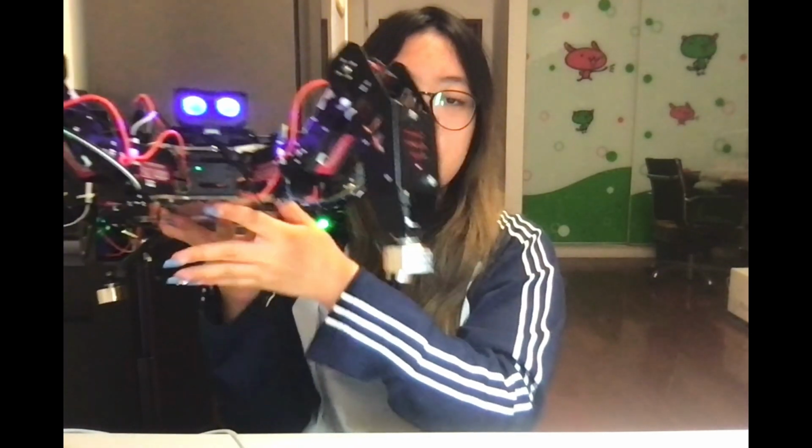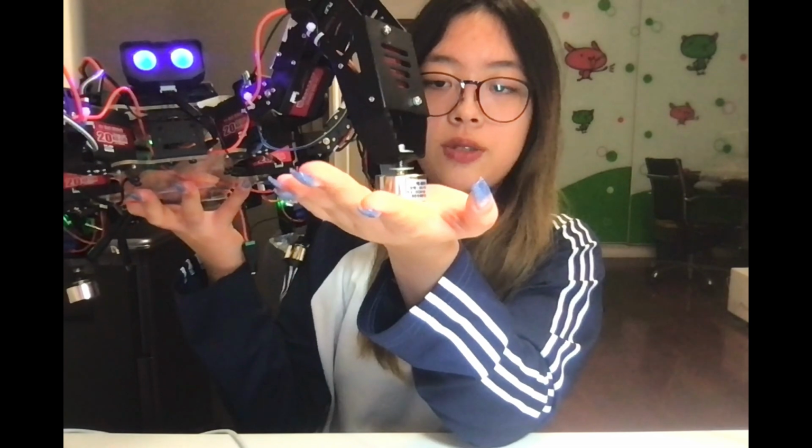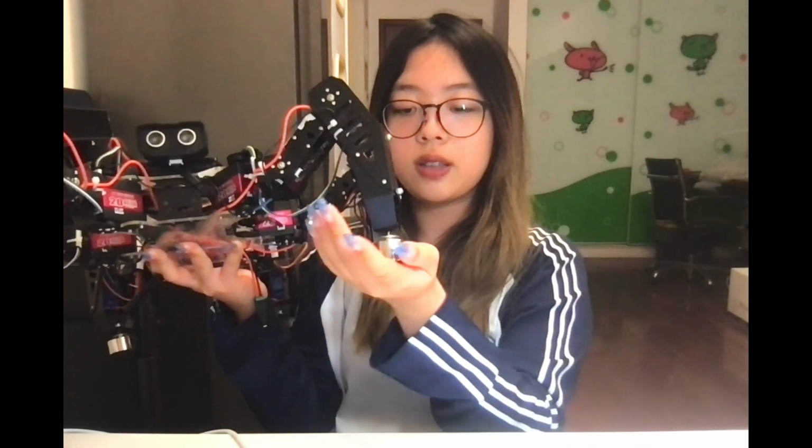this fake spherical joint is necessary to ensure that the joint connecting these 2 parts is loose. Like if they have a certain angle, it still can be pulled down and be attracted to the wall. And also, when the leg is moving forward or backwards, this part needs to be rotated at a certain angle. So this joint also ensures that. So then I recorded the gait movement data with the bus servo control.